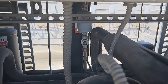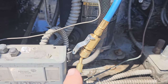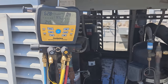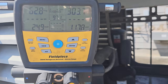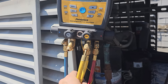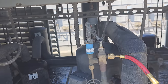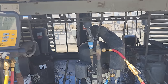The suction's fine — I know the superheat isn't too high coming back to the compressor. Sight glass is still clear. Oil level is a tad on the high side — it's above three quarters. I'm going to let it run for a little bit. Saturation temp doesn't look too bad compared to ambient temperature. It's about 100 degrees up here, and we're only about 20 degrees over ambient as far as condensing temp. I think it was just cleaning the condenser that made it operate a lot better.